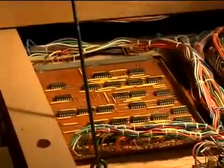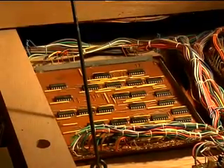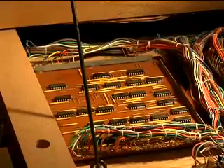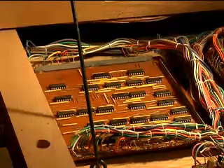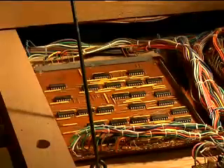The CMOS digital ICs on this board were built in the late 70s, early 80s, which is one of the earlier fabrication processes. There is a known defect in the actual way the chips are manufactured that causes the transistors in them to fail over time, specifically from ion or metal migration in the actual junction of the transistors.